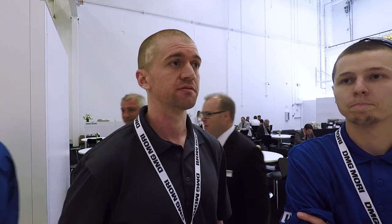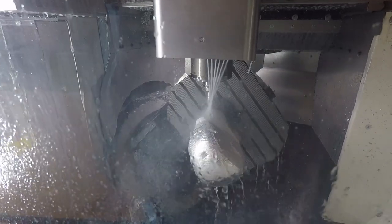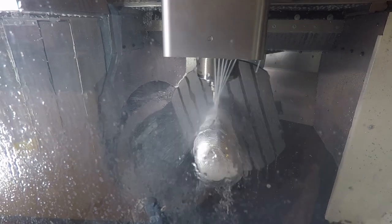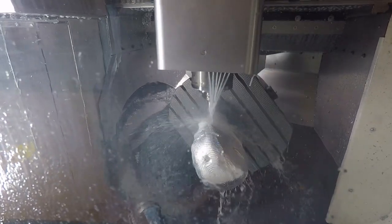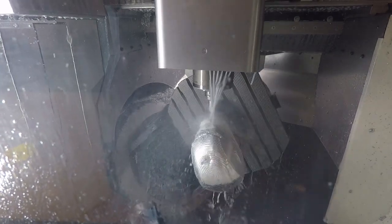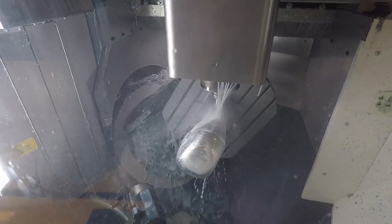The PS105 is more like a tool room machine - the PS95 was their bread and butter 40 by 20, and it pretty much phased into the PS105. Right now they're doing three-plus-two machining: a three-axis strategy while the machine is held in a five-axis orientation, but it's not simultaneous five. For good simultaneous five-axis, having a linear machine is the way to go.